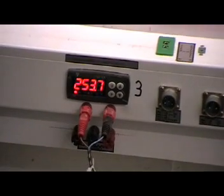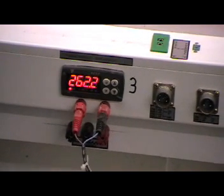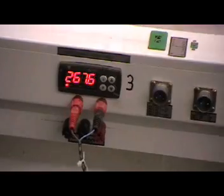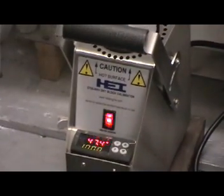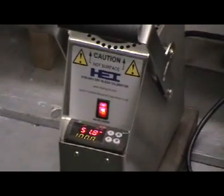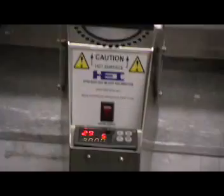Within a very short time we are already at 250 degrees as indicated. Looking back at calibrator number one, which was programmed and initialised at 100 degrees, we are already at 50 degrees. Looking at the other calibrators, you can see the stability of calibrators four, five, and six — at 600, it is approximately plus or minus 0.1 degree.